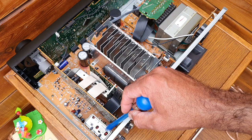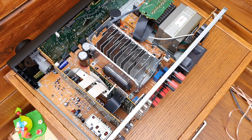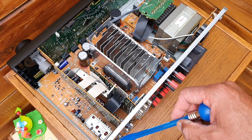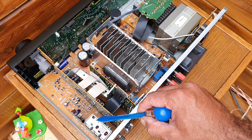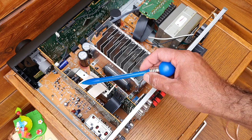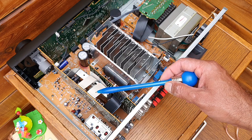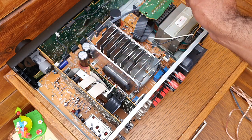The same tuner input block has been used in color television sets, for Sony and for the Japanese color TV stations. They were using a similar thing for VHF and UHF. So they also use it in AV receivers. So this is the tuner input. Then you have here the phono and the CD input, and these circuits have a built-in preamplifier, so they do preamplification and feed to the control board.